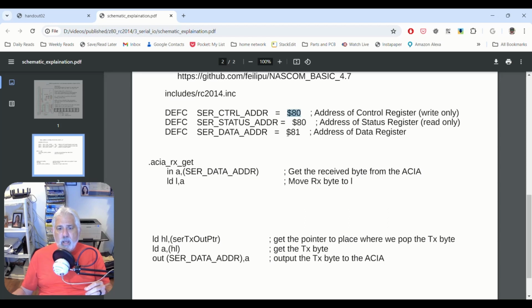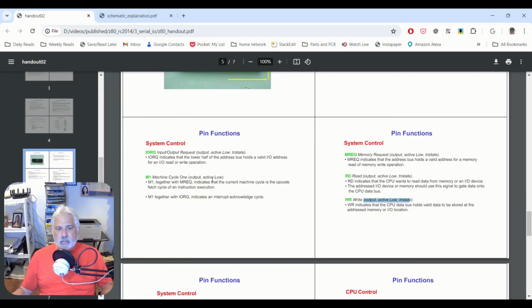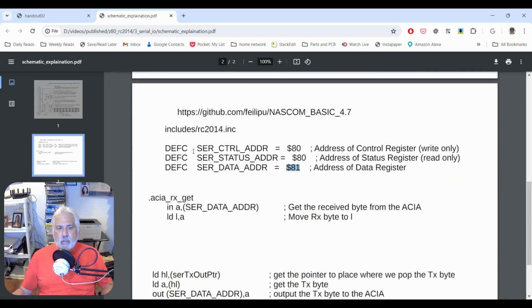talks on these ports. If I had designed the computer, let's say, the architecture, or you had designed it, you might have put that serial I/O port someplace else, because it's all simply controlled by the decisions that were made of which lines to use. We could have used other lines. We could have put different logic in here. But this is what the designer of our Classic II decided to do, which meant somebody had to go and modify this version of BASIC, because this version of BASIC was created like late 70s, I think. And obviously this computer didn't exist then.